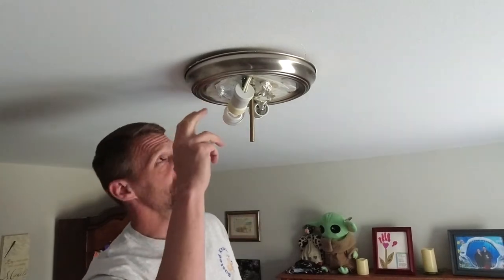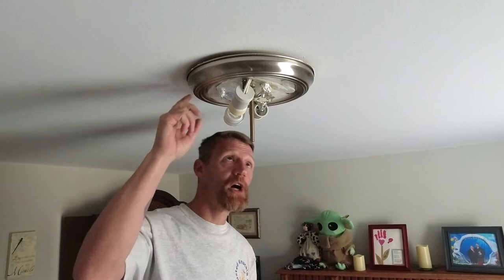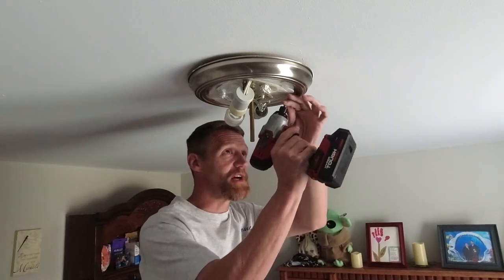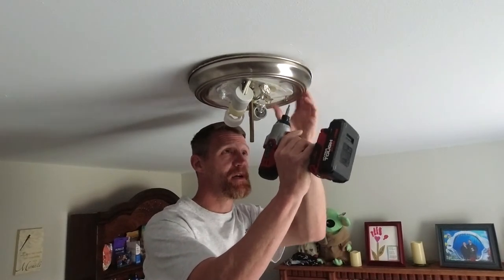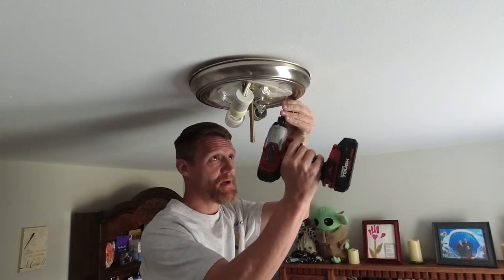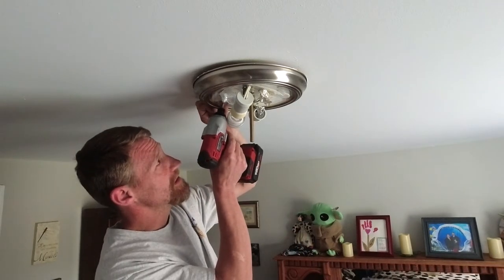All right, now that the globe is down, normally these have two or four screws holding them to anchors in the ceiling — normally Phillips screwdriver, nothing too fancy. But I can tell whoever put this one in probably didn't have an idea what they're doing, because there are big deck screws in it with a Torx head. More than that, it looks like they just drove it into the sheetrock with no anchor — really a poor way to install these. Anyway, we're gonna go ahead and get the rest of these out.